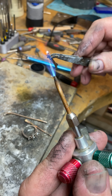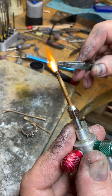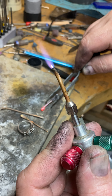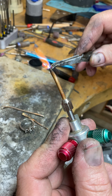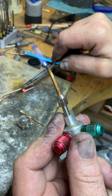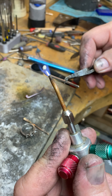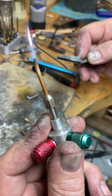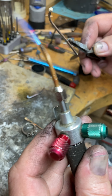I want to pull it back as hard as I can — you can hear it hissing. If you're trying to melt something with gemstones on the side, you want the metal to melt as fast as possible. This is actual silver. Now let's apply the same exact operation to white gold — we're going to go from here. You can see — watch my fingers.